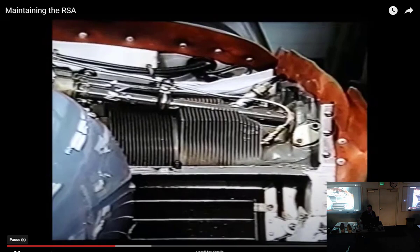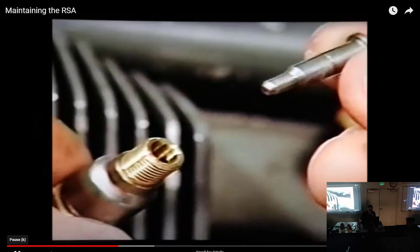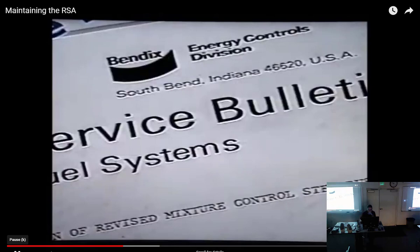Only proper inspection can verify a nozzle has been properly cleaned. An increase in indicated fuel flow at various power settings is generally the first indication that nozzles need cleaning. Engine operational problems occur if contamination becomes extreme. Substantial fuel stains around the nozzle also indicate the need for cleaning. And, like the filter, any unusual contaminant should be identified and its source located and corrected. Be sure to refer to Bendix Bulletin RS-77 Revision 2 and Lycoming Service Instruction 1414.